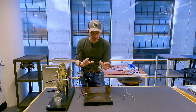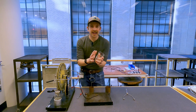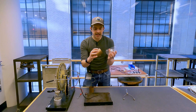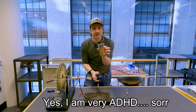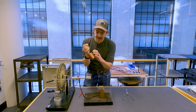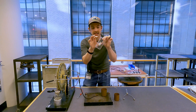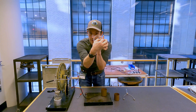What's happening here is a little bit tricky. The point of the demonstration is to show that the energy is in the field. But if this were a perfect insulator, this actually wouldn't work, because you can't store a charge on an insulator. There's a little bit of water molecules on the surface of this, and that actually allows the charges to lay on the surface. So what's really happening — the real physics — is that I'm putting a bunch of charge on this outer shell and a bunch of charge on this inner shell, separated by the dielectric. By the way, this capacitor is called a Leyden jar — one of the oldest types of capacitors around. The excess positive charges are getting deposited on the inside of this glass, being stripped off and deposited there. And when I pull this out, the excess negative charges are stripped off and deposited on the outside. So this piece of glass has negatives on the outside and positives on the inside, and the electric field still exists across the glass — that's where the energy is stored, in that electric field.